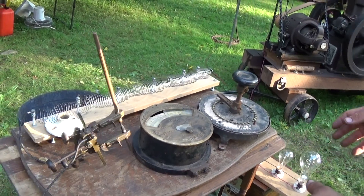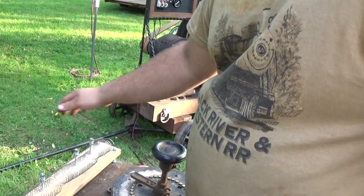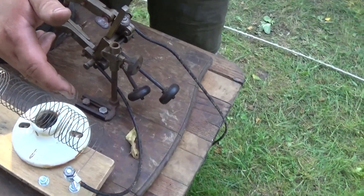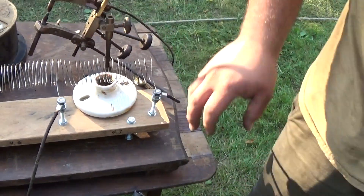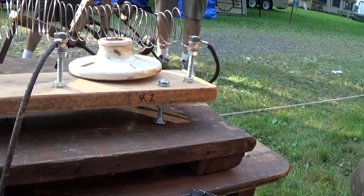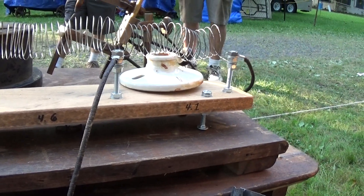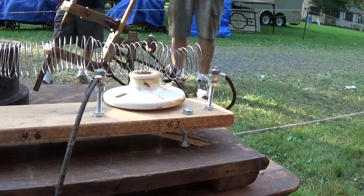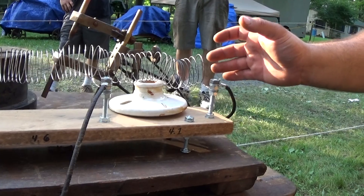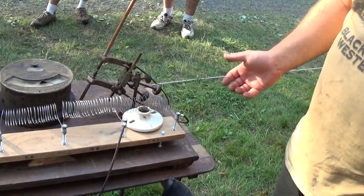Now the engine's running, we'll give you a little rundown on what we have. I'm taking power from the generator set, passing it through a 20-amp fuse, then coming up here with this lead wire. This wire here is going through this little coil of nichrome wire — 18-gauge nichrome wire. This coil is approximately 4 ohms, 4.1 ohms. I wound these coils up specifically for this experiment. The arc has very, very low resistance once the arc is struck, and in order to prolong the life of the carbons and make it more controllable, we have to limit that current. We're running on DC power, so limiting the current pretty much means we've got to use some kind of resistance.